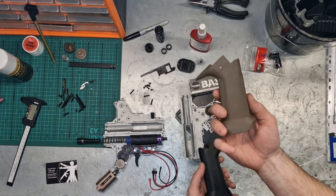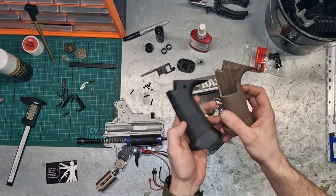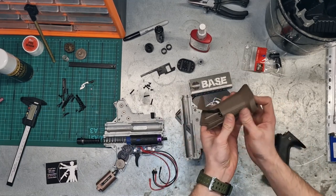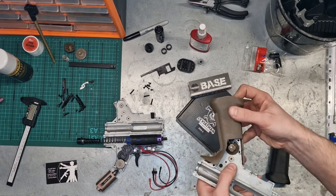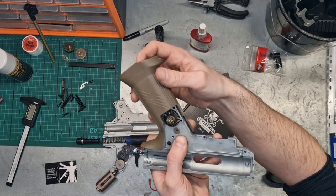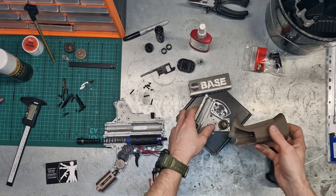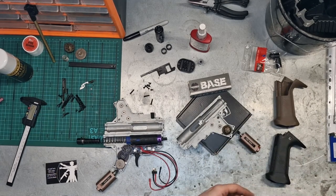All I've done with this is chop the side off — as you can see there's a nice big hole in the side. So if I drop the motor in here, obviously the baseplate is going to have to transfer across, and I put that together and screw it all together as you would normally do for bevel to pinion. I can see exactly where the gears are meshing together, making my life a lot quicker and easier, and saving the customer a few quid in the process if you charge per hour. That's the tech tip of the day — cheers chaps.